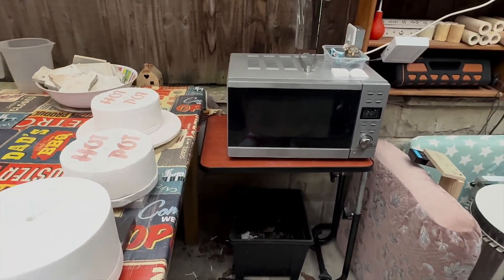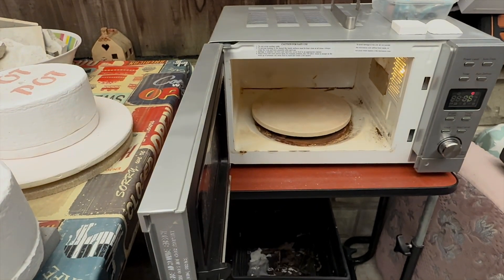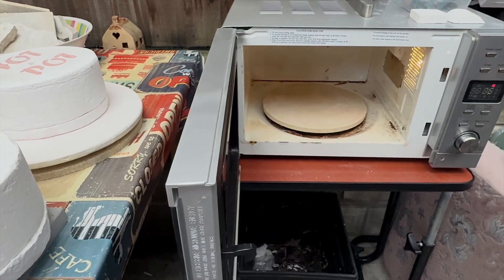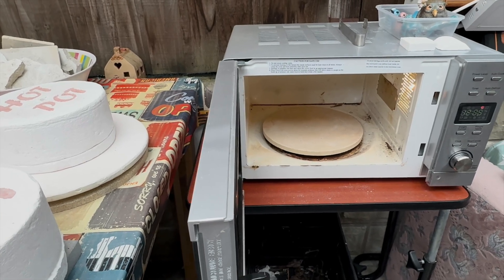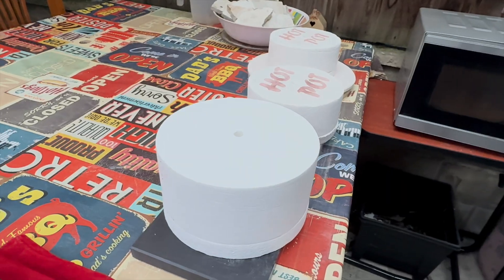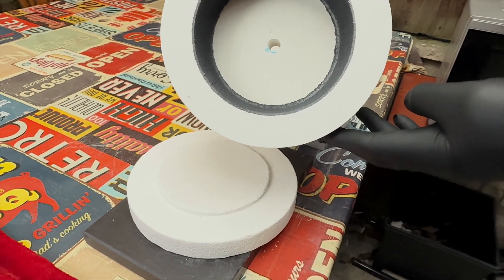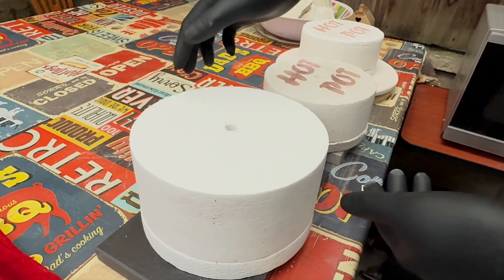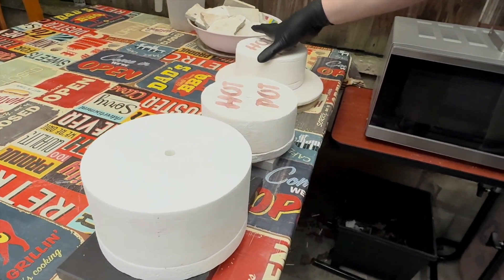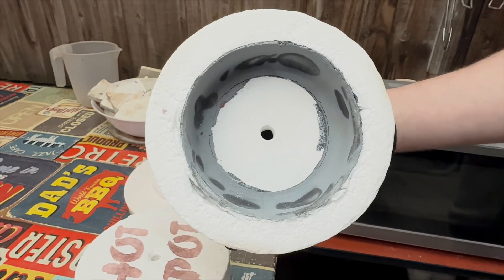So here's our equipment. This is our microwave, and inside we actually have a very small kiln shelf instead of the glass plate — it's been used a long time but it still works. And here we have our microwave kiln, which is basically made of ceramic fiber. We have a big one and two small ones. These kilns have been around a long time; mainly people use them for glass fusing. The inside is coated with graphite, which is what heats up in the microwave.